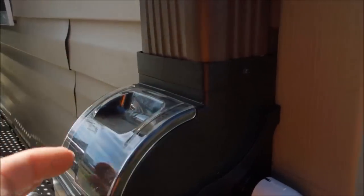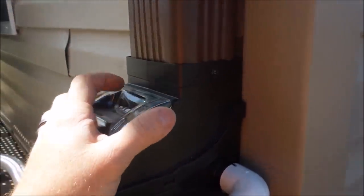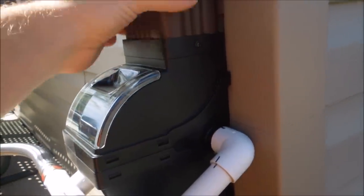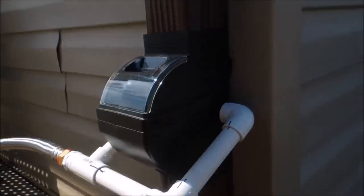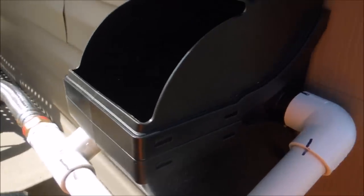It's a pretty cool little deal. You just cut your downspout — I have six-inch gutters so I have the bigger downspouts. With a metal roof on a decent pitch, six-inch gutters will keep the water from rolling off the roof so fast that it'll actually catch it. The Fiskars Diverter Pro comes preset for the bigger downspouts but also comes with adapters for the smaller downspouts. I did read some reviews about leaking with the smaller one, but most fixes involve some silicone and it's good to go. The cool thing is it has a brake system that catches bigger objects like leaves or twigs, which flow right off the top and on down the downspout.